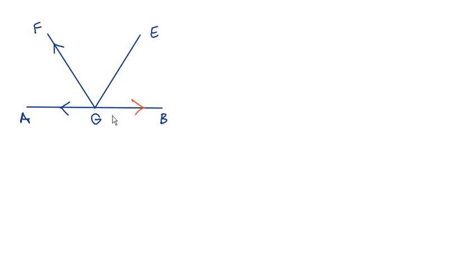Okay, very, very seldom do you have these two forces acting in the same direction. If both these forces are going the same direction, what does it mean? It means that this point here is moving to the left, and it's not moving to the left. Our frame is in equilibrium. So if you assume GB to be going to the right, most probably you're making a good estimate. GE, however, is the one that we cannot be sure of, and I'm going to assume it to be in compression, so it's pushing toward the joint like that there.